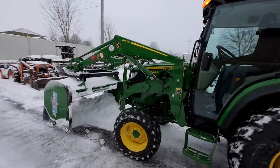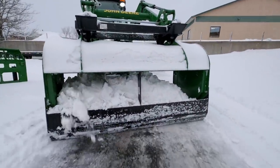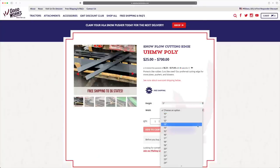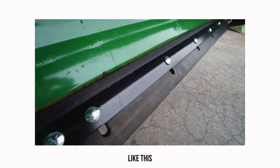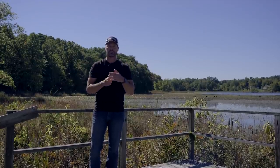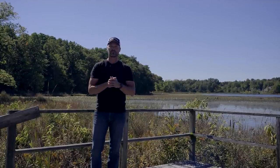You're not going to leave rust streaks or stains, and you can help prevent any chipping from a steel edge along an uneven surface or expansion joint. We do sell UHMW edges in different heights and widths — you can buy per inch on our website and ship UPS ground right to your house. This material drills out very easily; just add stainless nuts, bolts, and washers and bolt it on. It does not need a retainer bar like rubber normally does. Also, for those unfamiliar with snow equipment — if you have replaceable edges on your plow, pusher, or snowblower, they are often reversible, so you can wear down one side, flip it, and get double the life.